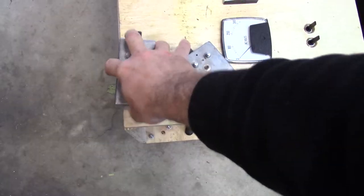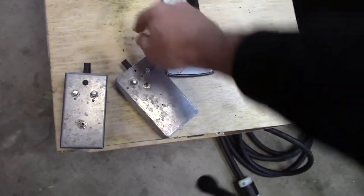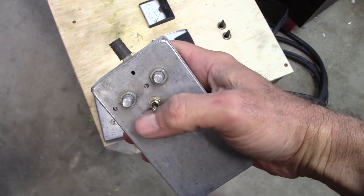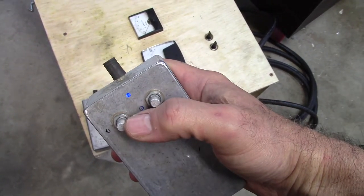I should mention these bad boys here. Obviously these things haven't been used in quite a while — there's a little bit of mold on this, that's how long it's been since I've run these coils. These are our interrupters. The 9-volt battery in them still works. The purpose of an interrupter — it's only used for a DR coil, a solid-state coil — is that it generates the pulses that fire the coil itself.